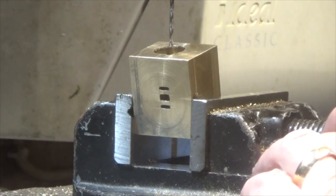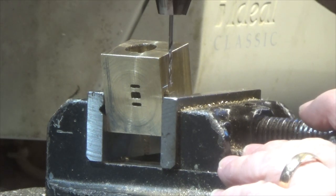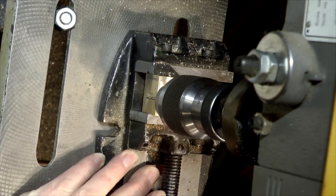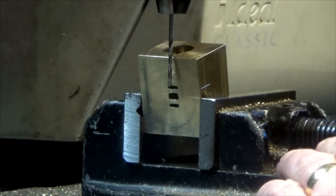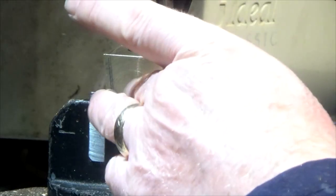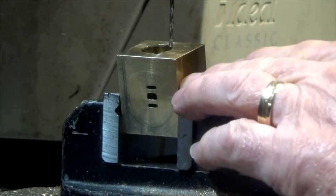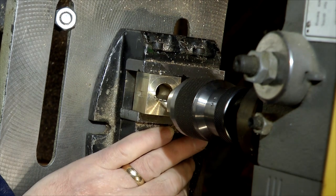I've got the drill set up at an angle which looks more or less right. I've set up some crosshairs and I know the depth where the port was milled out to — I've set a depth on that, and also set the depth on the drill so we can't drill too deep. The problem is if I'm too low I might miss and break through underneath. The worst that can happen is the drill hole ends up underneath where we've milled, in which case I'll just drill a little hole in there to break through. So we can start now.